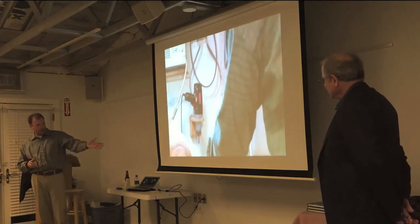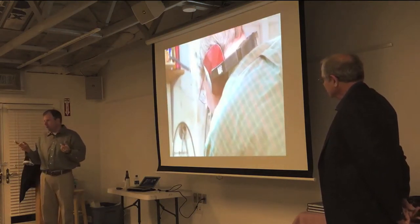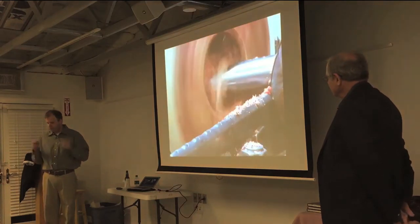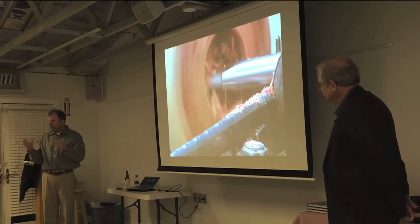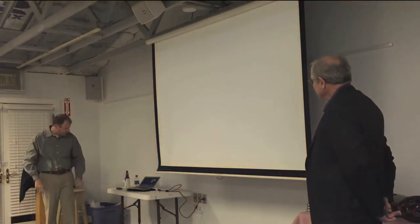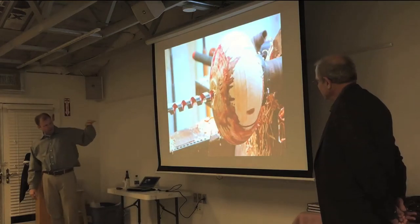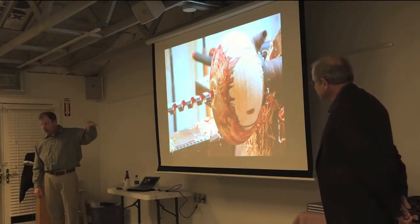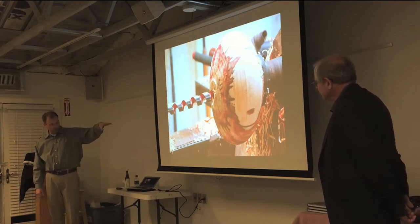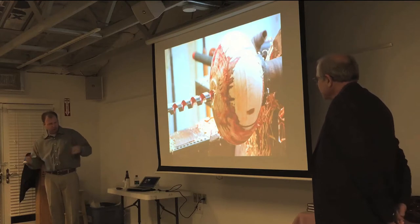And that's the inside hollowing, what we call the rough form. The pieces are done from a log to essentially just a rough form of what the final piece will look like. You can see on the inside of the piece, we use an auger to bore a pilot hole, and that's how we start to hollow it out, right? Yeah. Hollow form of the vessel.